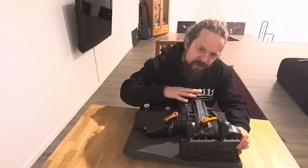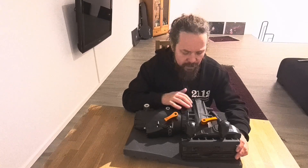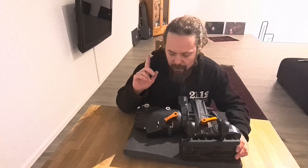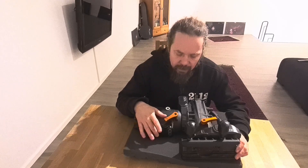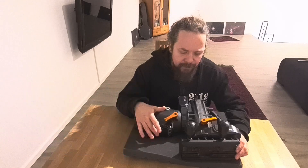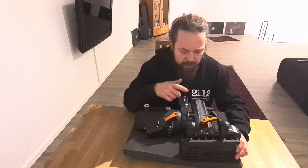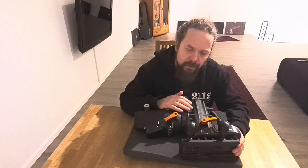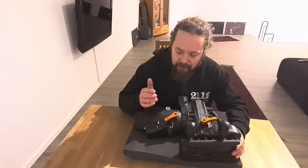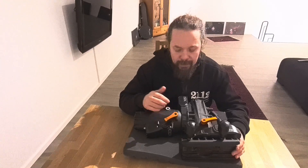That also points towards a sensor line issue. It does say 'invalid model,' so it could be that it needs the sensor information to know which model it is — like, it's a CGX mount, et cetera. However, while doing that I felt that the temperature on the controller was really, really hot. That made me think maybe it's the MCU that's bad. I checked the cables and they looked all right — I could see continuity through them. So I felt it could be the MCU. I found one from Deep Space Products, ordered it, got it, replaced it — and it's still the same fault.